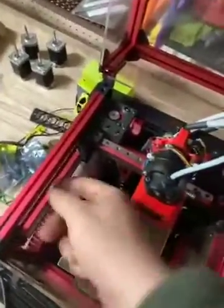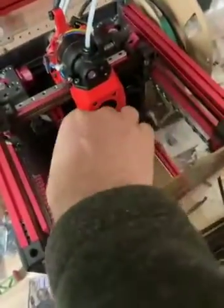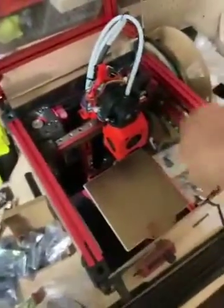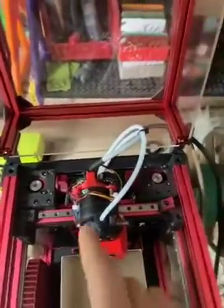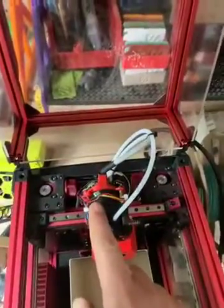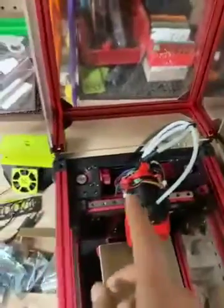Push them in — both of them — and then take your fingers, find this first one here on both sides, and pull them to you. Pull them both in; that gets all the slack in the middle, which is fine. You want the tool head in the middle. Basically, home it, send this thing all the way back, then kill the motors, and then unscrew — obviously.